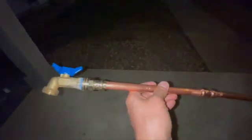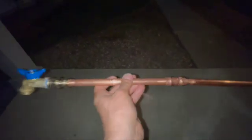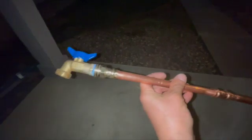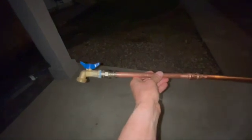After an incident a couple weeks ago, a customer called saying that a repair I did using Viega ProPress fittings had failed and caused water damage. I've been using the Milwaukee ProPress tool for about a year and have never missed crimping one of the sides, so I didn't know what could actually happen if you did. After looking online and not finding any video or explanation, I decided to put this together and test it.